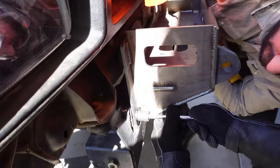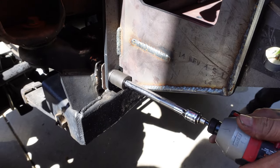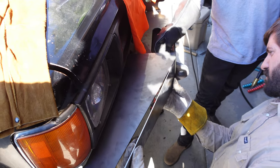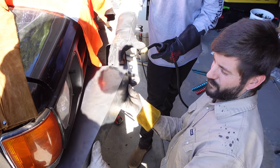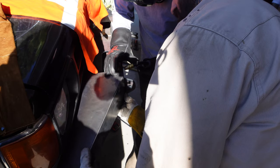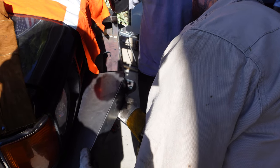That thing's starting to look like a bumper. Now we're fitting up the pieces that make the body of the bumper. These kits come with instructions so you know what piece goes where, and they're also labeled. I'm holding this top plate in place and my buddy Chris is lining up the front plate while Ryan tacks these into place. We're just tacking everything right now since we still want to be able to move things around, and in case we mess up, it's a lot easier to grind or break a tack. After everything looks right, we'll finish weld.